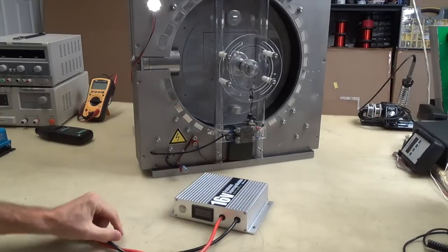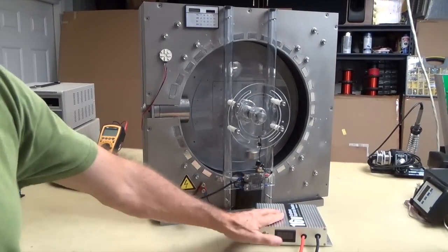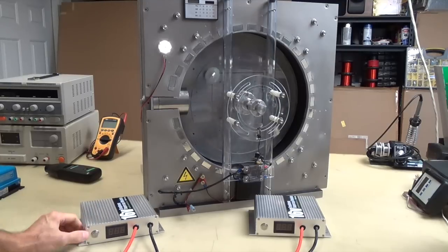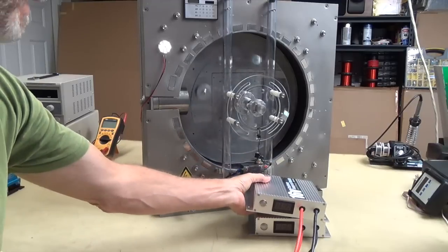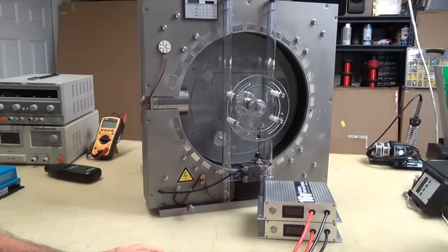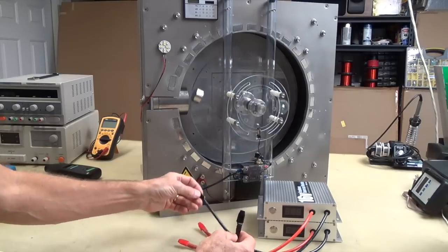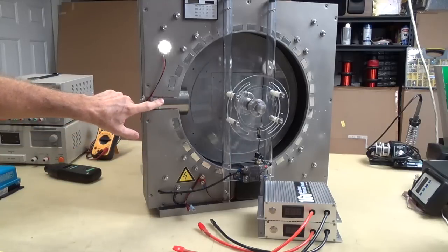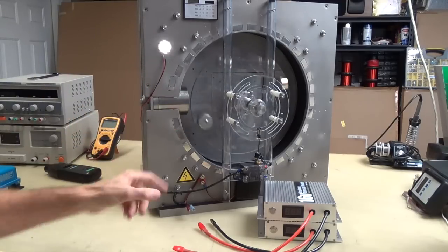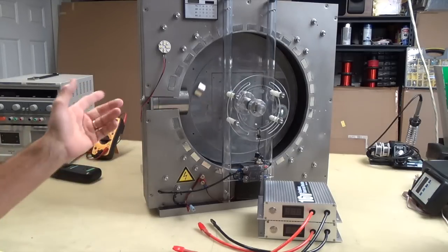This is it. So if you take this and you're running this, and then you can take another one and it can be charging. It doesn't matter. You can put these two together if you want. Just stack them. Yep. Or 3 or 4. Or whatever you want to do. How much power do you want to put in? How much power do you want to get out? So 32 volts, put them in series. Put these suckers in series and run the thing on 32. It'll pulse this. It's only meant for 24, but when you're pulsing at one time, a fraction of a second, even if it's doing that 5 or 10 times a second, this thing barely even gets warm. It's only designed for 24 volts, but put 40 volts in it, or yeah, I haven't gone over 40 volts.